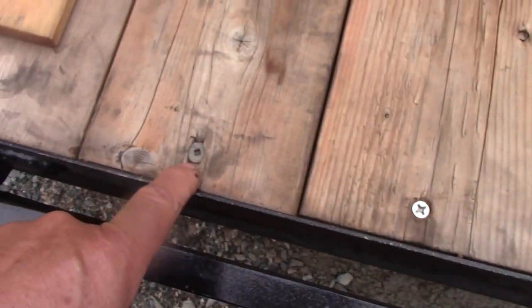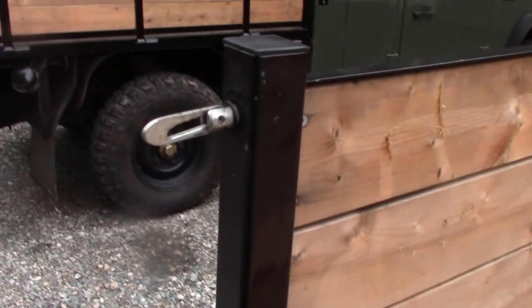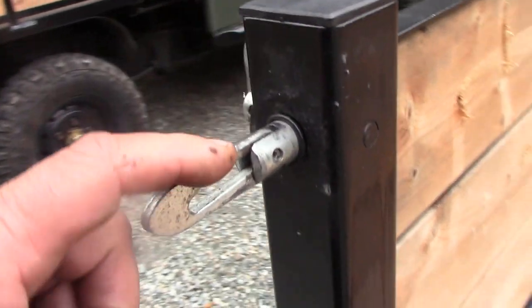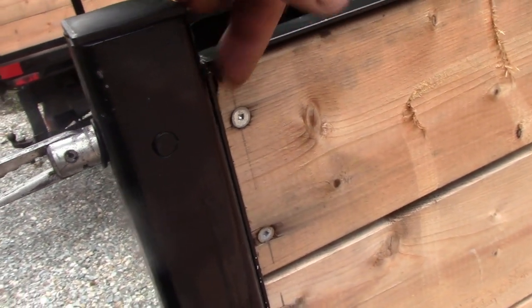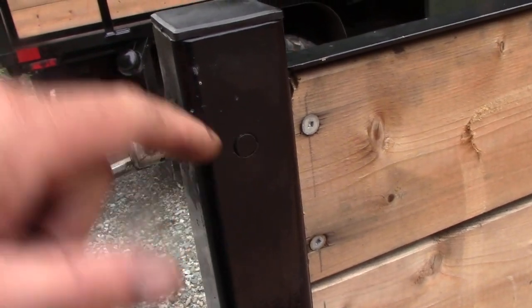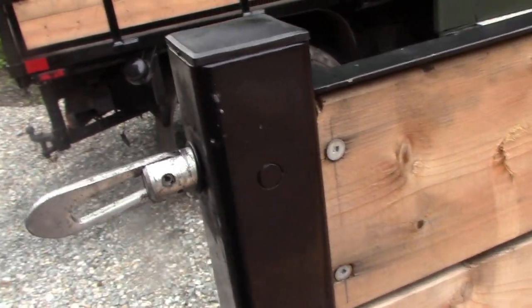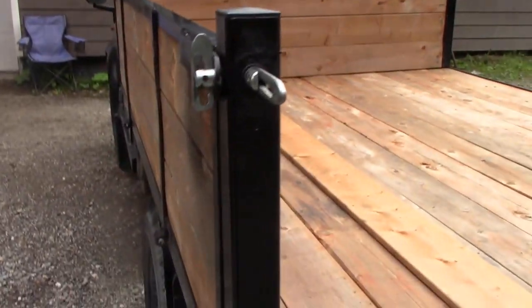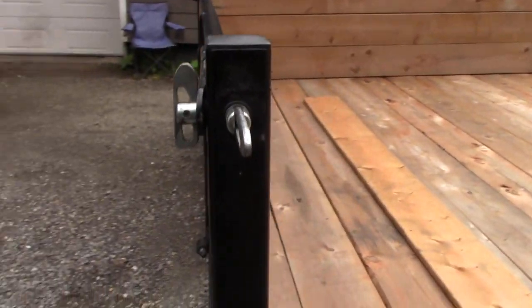You can see Phillips screws for the removable boards versus Robertson screws for the fixed ones. The O-ring just sat on there and seems to work well. When you buy these threaded pins, I welded them in from the inside and put the caps on. One is slightly above the other but you can compensate by fitting the plates at slightly different heights.